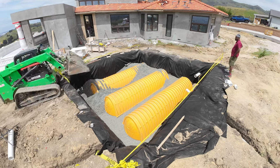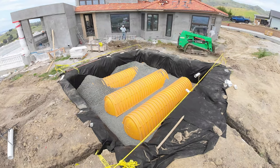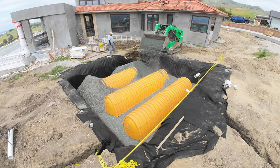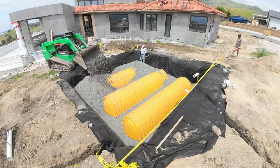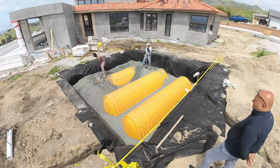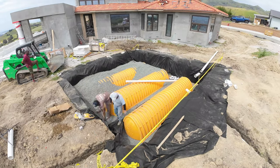The water will come out through the six-inch pipe and through the four-inch pipe, and it will come into that dirt. That dirt will filter and clean it from any chemicals from the driveway — California requirements. It will go down to the bottom of the drain rock, where these chambers sit on about six inches of gravel, and then kind of go into the earth.